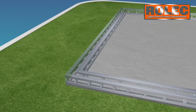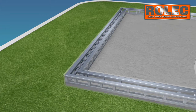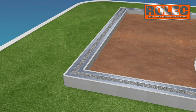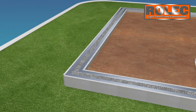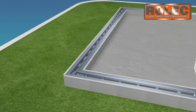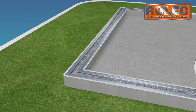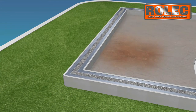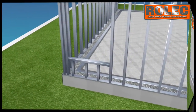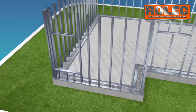The Pinnacle foundation. Step 1: Place light gauge steel tube on well compacted or undisturbed soil. Step 2: Screw concrete form tiles through pre-punched holes onto the vertical sides of light gauge steel. Step 3: Drop rebar reinforcing into pre-punched surface holes of the outer light gauge steel profile. Step 4: Cast 25 MPa concrete into cavity and vibrate.